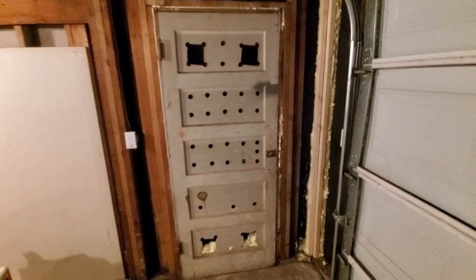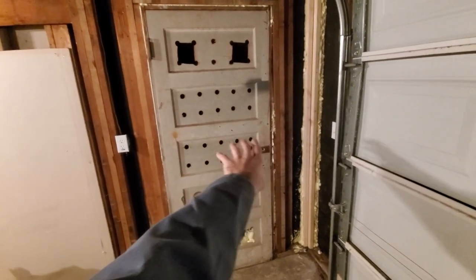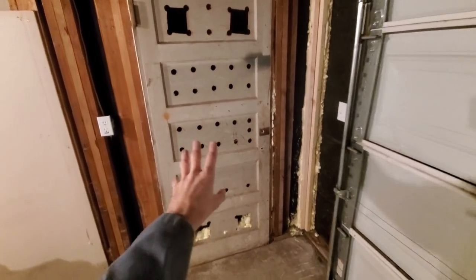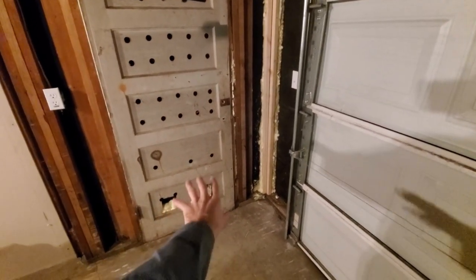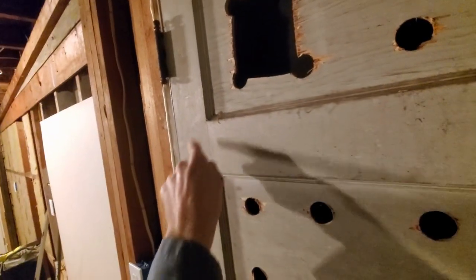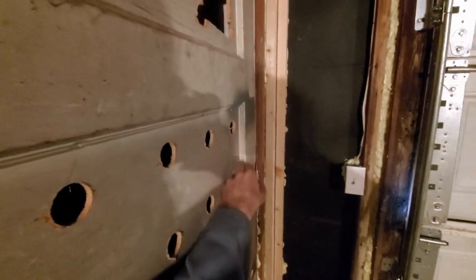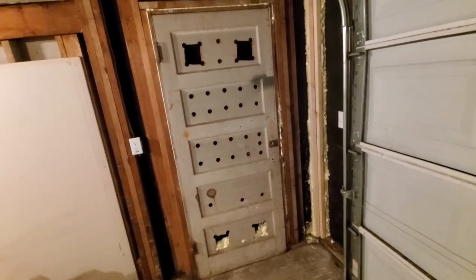We're finally on the last corner. This door was sealed off when they put new siding on the house before I purchased it. I didn't know what kind of backing they'd put behind it since they had bolted the door shut. I drilled some holes and found they had just braced it from here over, so in the center there's nothing. I thought I could fill it with spray foam, but realizing how open and hollow it was, I decided to get some blown-in cellulose — I'll chop it up and fill it to here so I don't use as much spray foam. I put spray foam at the bottom since if water gets in, spray foam doesn't rot but cellulose does. I'm going to cut the hinges off with an angle grinder and bolt screws into the side so it stays tight for a smooth drywall surface. I noticed about a half inch of play here, so I may cut foam board pieces and use foil tape to seal them up. It won't be a perfectly insulated wall, but I'm hoping for a halfway decent R-value.